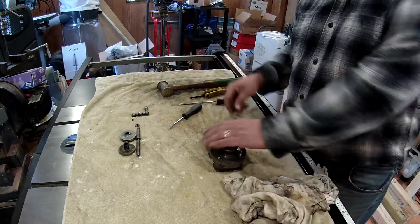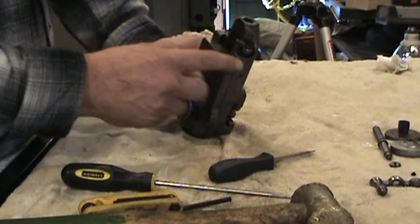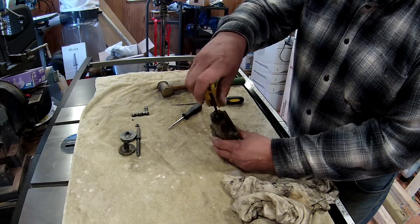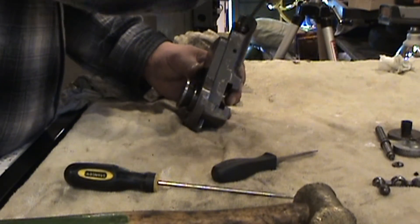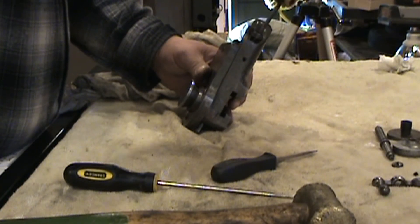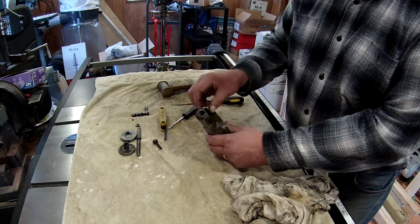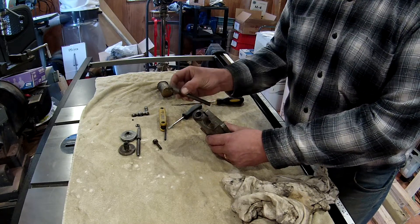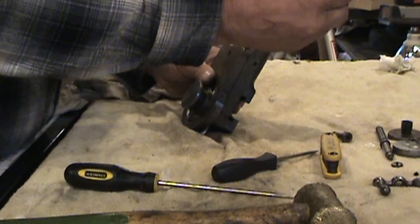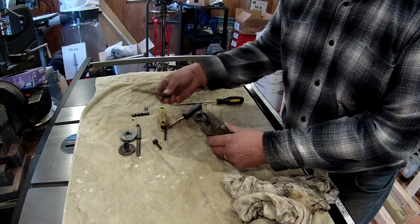What we have here is the GIB screw and the GIB — it also takes a 3/16 hex. We're going to unscrew that and take it out. You can see the GIB coming out with it. That's the screw that screws down in, and here's the GIB. You can see it's got that slot to hold the head of the screw, and you can push that in to tighten it up because it is a tapered GIB. It slides in and puts more tension on it.